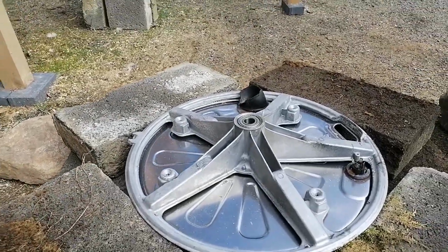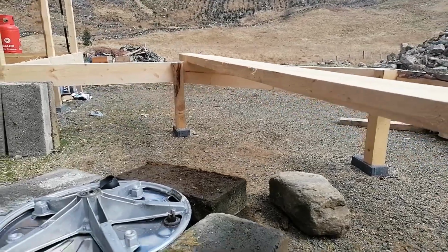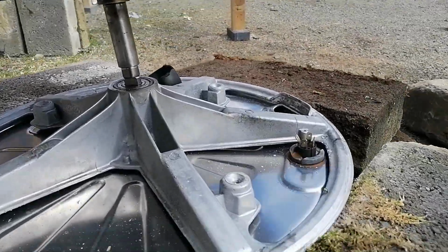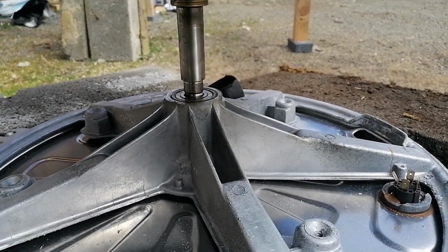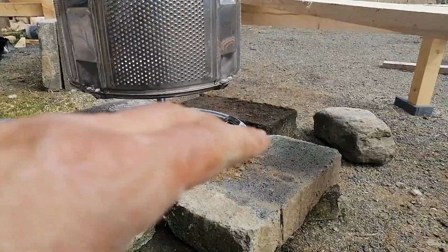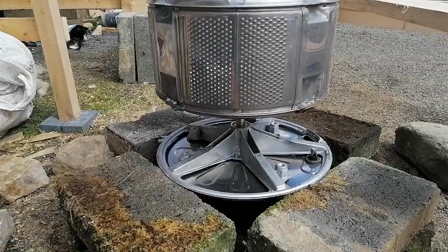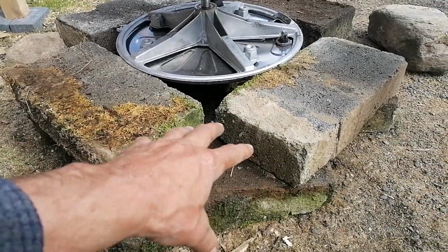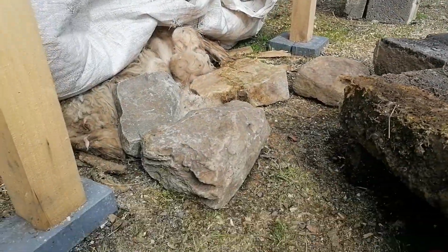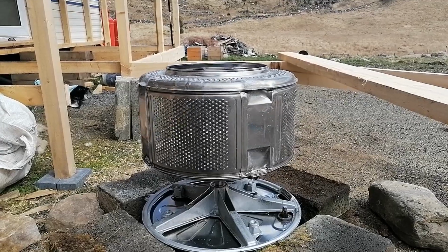That'll come out. And then I've just laid that bit of 6x2 across there, just to get some idea where the deck is going to come. So if I raise that up maybe another two courses, you can see the top of the... That drops in there. Obviously it doesn't rise as quickly when you're only laying them on edge, but if I lay them that way round, it means by the time I get to the deck level, I'll lay a piece in here to fill in this gap on the last of the block courses, and that gives me a really nice base to start fixing all the stone, which are going to be around that kind of size. And then I can just build the stone around the drum. And I think it's going to work really nicely.